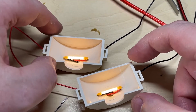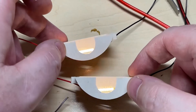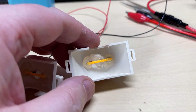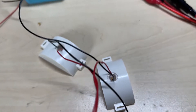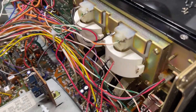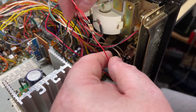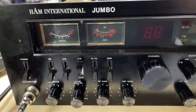Here are the LED COB lights that I've been using on signal meters on the UK FM modifications I've been doing. We're not running them at full brightness — only at very low brightness. We mount them in place with a little bit of hot glue to keep them in place, and there we have them reinstalled back into the radio. The only thing it needs now is a current limiting resistor. It worked out that a 1k will drop it far enough so the LEDs aren't too bright, but they're bright enough.